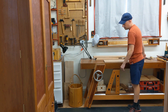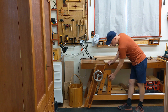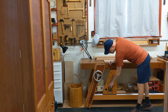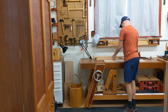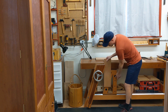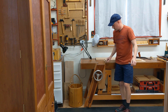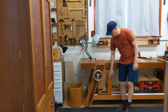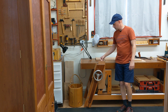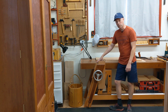If you pair the angled leg vise with a matching sliding dead man, you'll notice this dead man has two legs and one of them matches the angle of the leg vise itself. That means I can put a dog stop in that sliding dead man and support work pieces from underneath. I can place something in, bring it in — it's next to the vise screw but not racking, and it's supported from underneath for chopping operations or pounding. It's about as solid as the workbench itself.